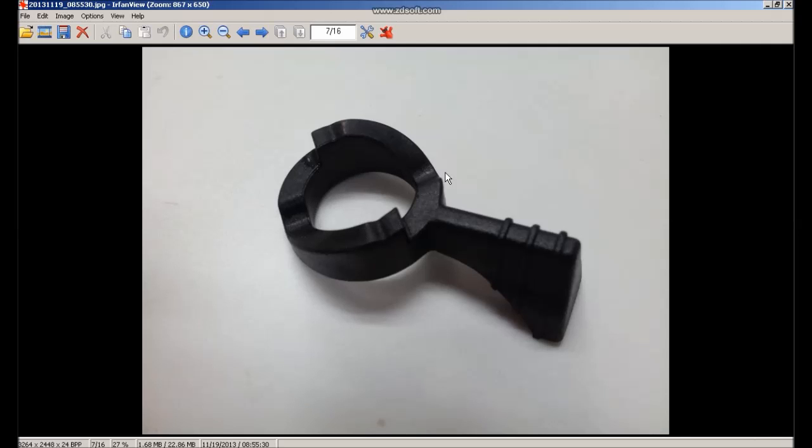The pin's initial position will be mounted on this groove. When we twist, when we turn this knob, the pin will be moved and will stay in this smaller groove. So it will lock in this position. If you look, there's a repeated curve. We have a flat surface in a groove, then it goes upward, then we step downward, flat surface, and this flat surface is the same thing, repeated. We have a groove, then the curvature goes upward, a flat surface here, then a smaller groove here. So it will be a kind of repeating process.